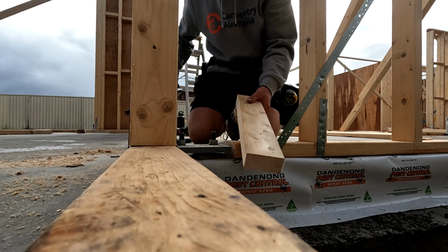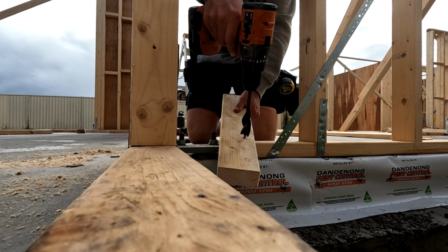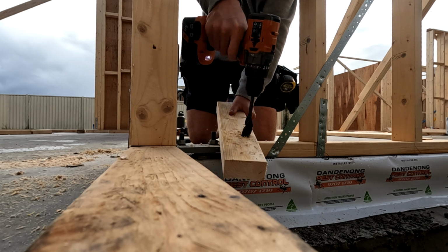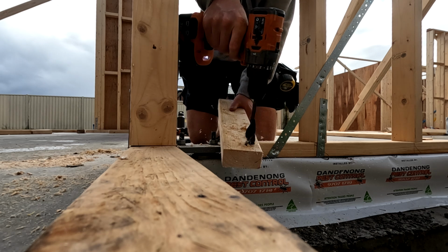While Mitch has been doing the concrete screws, I went through and finished cutting out everywhere for the steel, and as you can see, some of the columns are in. In terms of connecting the steel to the frame, I'm firstly going to double up this bottom plate so it runs all the way through into the steel column and butts into the stud on the other side. And as you can see, we've gone through and drilled out a few holes for those threads to sit in.